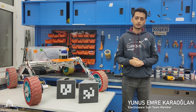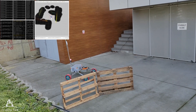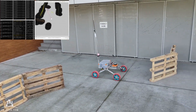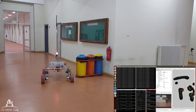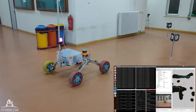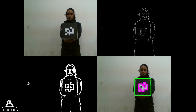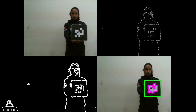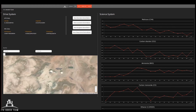The state machine model is chosen and integrated into the autonomous navigation system to switch between nodes. Artificial potential fields and map-based A* algorithms are being implemented to navigate effectively through the goal point while avoiding obstacles. MoveBase is also configured as a backup plan for path-planning algorithms. The open-source Alvar ROS package is used for AR-tag detection and localization. The user interface developed last year is improved for more accessibility for the operator.